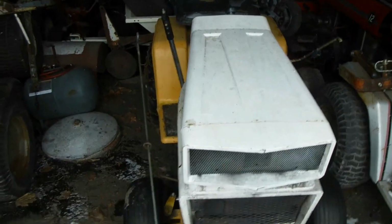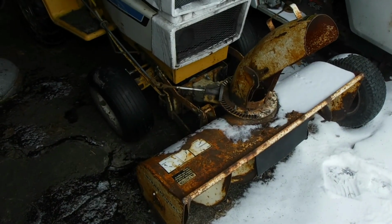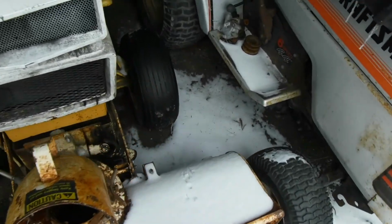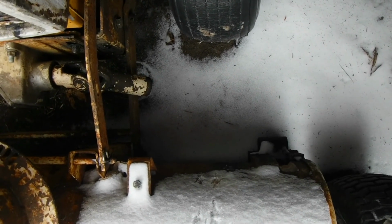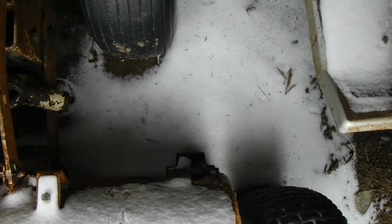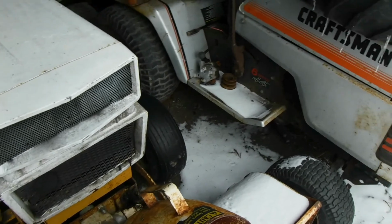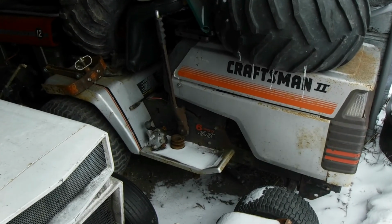In the middle, we have the 1000 with its QA42A snowblower, which is currently down for repair because I had a needle bearing blow up on me while clearing the driveway, and it damaged the little adjuster thing. So I got the adjuster bracket back, had it welded up, and then I'm waiting for a new shaft to be made up. The GT6000, awaiting a heart transplant.